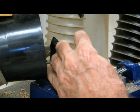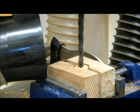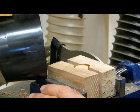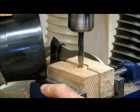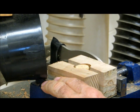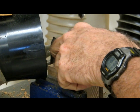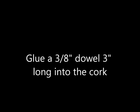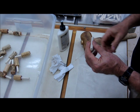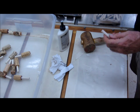I'm processing corks here. It's about a 15 to 20-second cycle time once I get going. I have the drill set kind of slow to prevent tearing the cork very much. I'm going to glue a 3/8 inch diameter dowel that I've cut off on the bandsaw in about 3-inch lengths into the corks that are drilled.